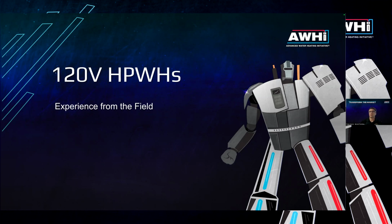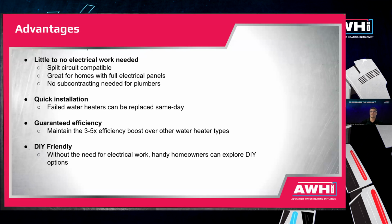I want to start by talking about some of the key advantages we found with these water heaters as installers. First and foremost, the biggest advantage is definitely that there's little to no electrical work needed because of being able to just plug into an outlet, especially when it comes to the split circuit compatible models. It's great for homes that already have maxed out electric panels, or even for homes where the homeowners are planning to electrify more appliances so that way we're not taking up space on it.